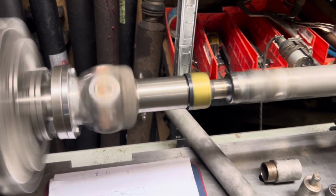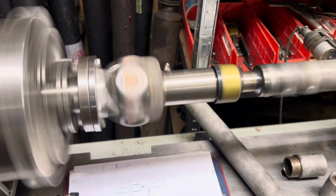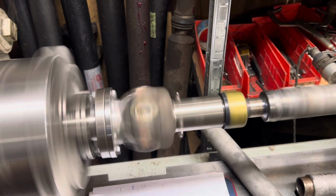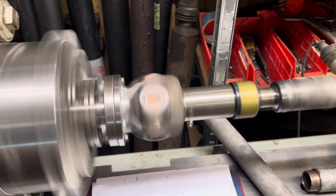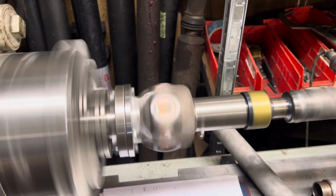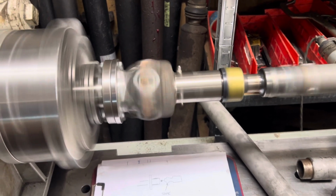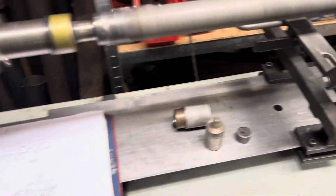The output of the overdrive that they're putting on there had a round flange with a 2.530 female pilot and a rectangular bolt circle. It was 2 inches 20 thousandths in one direction and 2 inches 400 thousandths in the other direction, so it was a rectangular bolt pattern. I looked to see if it crossed over to something metric, bolt to pilot diameter and bolt pattern, and it didn't really. And the overdrive unit, I'm told, is equally vintage, so who knows, they probably didn't make a ton of them. So this is what the drive shaft looked like.